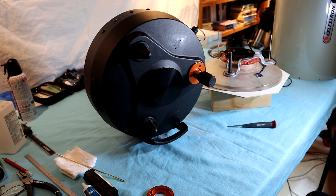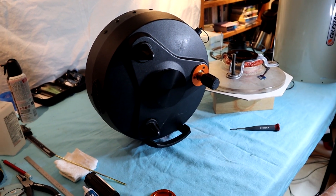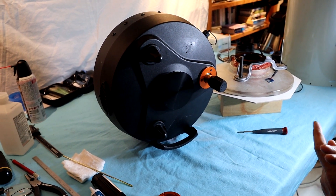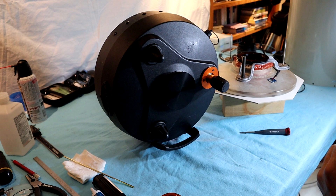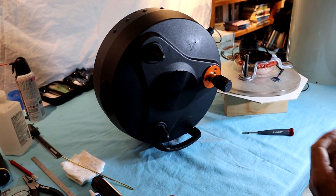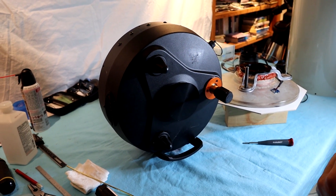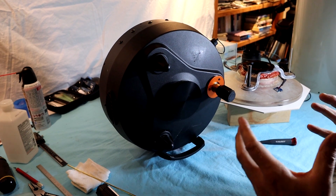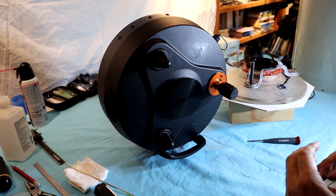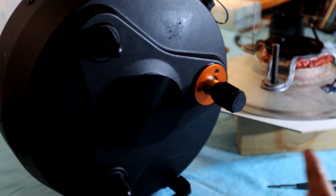The main reason for tearing down the telescope was to try and improve the stability of the mirror so that when doing focusing or meridian flips, the mirror doesn't move. What we were tempted to do is fix some of that by putting in some nylon screws along the baffle shafts to tighten up the mirror couplings. But we've learned in the process that there's another area just as critical, if not more critical — and that's the focusing hardware.